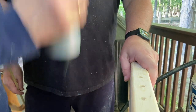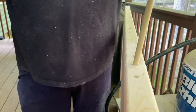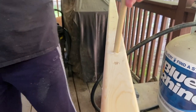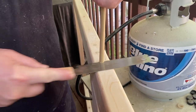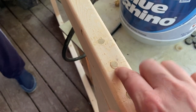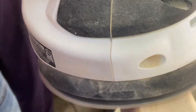Here we are putting glue into the recesses we created — and that's a bit too much glue! We use a little percussive persuasion to get the dowel as far down into the hole as possible, and then we use the flush-cut saw. It looks really nice and any slight proud surface will be taken care of easily by the sander — a little sanding makes them flush with the rest of the board.